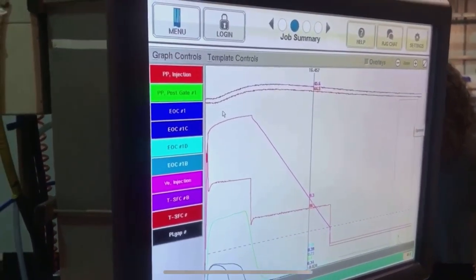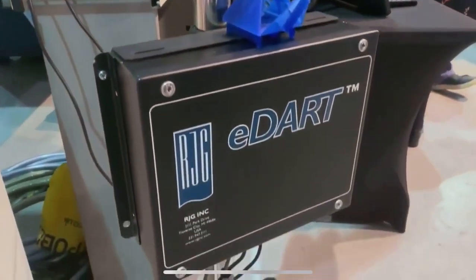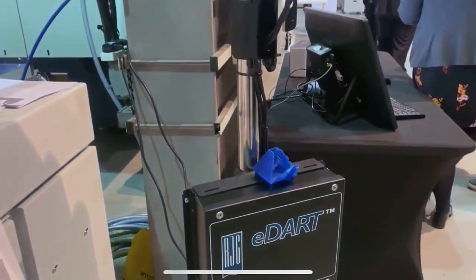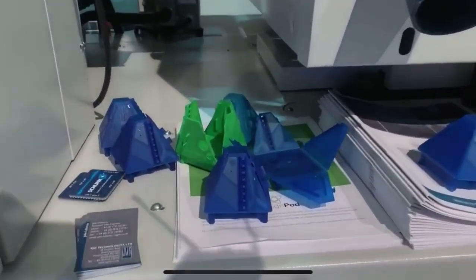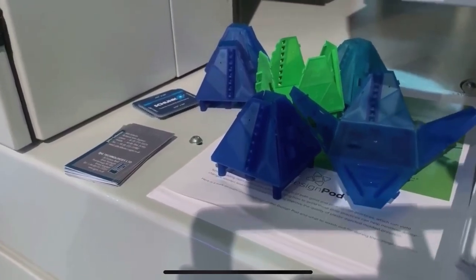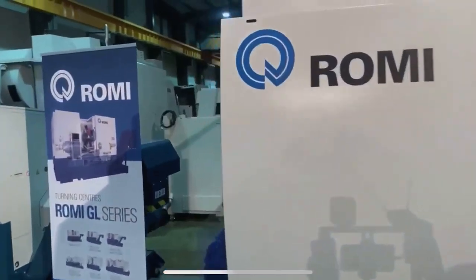We're actually monitoring mold deflection. When that high pressure plastic comes in at 200 bar in this case, we have to stop the mold from opening or else we're going to end up with what we call flash all over the part. So we're measuring how far apart the mold is coming when we're injecting plastic at high pressure — in this case 0.01 millimetres. That's important because if we had 0.1, that would be a disaster, causing flash, which would ultimately be rejected parts.